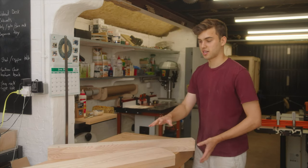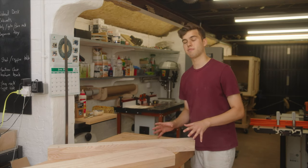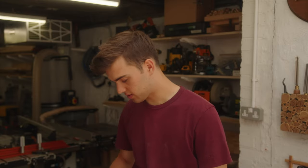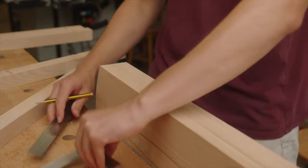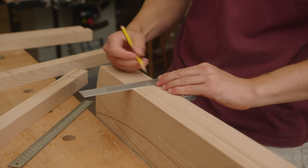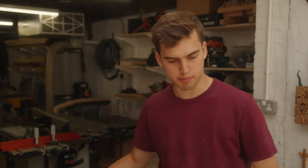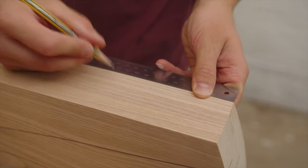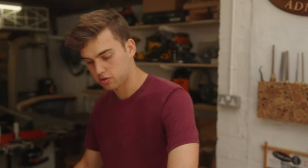The legs are done and the shelves are done. Now it's time to mark out the hole placement in the shelves. Once that's done I'll add a chamfer to everything and then it's time to assemble. The legs are going to be inset 12 centimetres from the edge of the shelf. I'll mark that with a pencil and use a square to mark all three shelves at the same time, doing that on both sides — 12 centimetres from the edge.